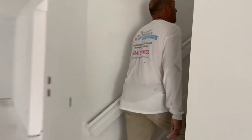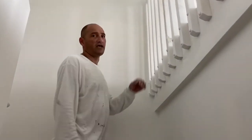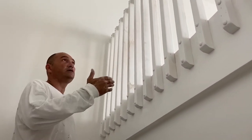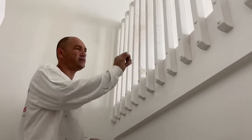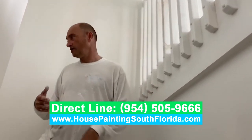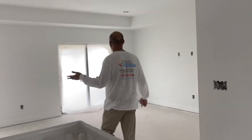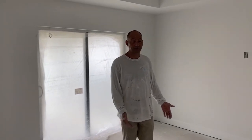All the railings and banisters are primed already. A lot of imperfections show up when you do the primer, so once everything gets really dry, you go back, sand it, do some caulking, patch and putty the holes, and then get to the final coat. In the first video when we started spraying, look how nice the ceiling looks. On the construction floor, it's all part of the process.